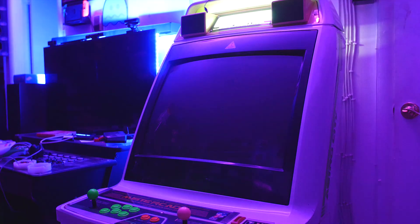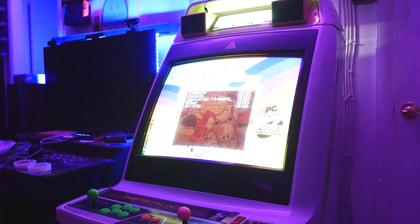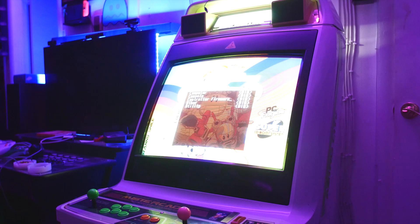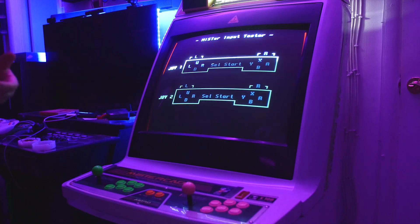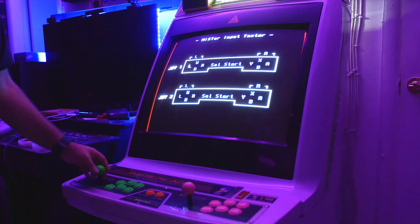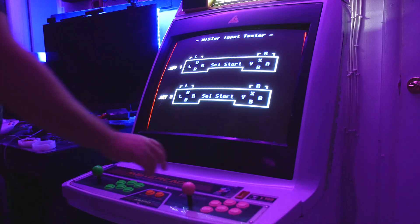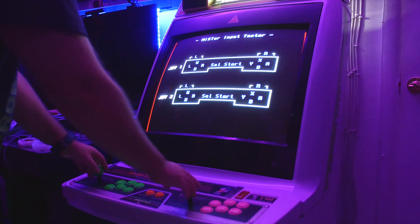The Sega Astro City is turning on — get ready for high quality graphics and sounds. No way! The very first time I plugged MrCade into my arcade cabinet it booted up and within seconds I saw the familiar MiSTer interface we all know and love. However, my harness wiring was off — very off. I press right and it goes up; I press left and it goes down; up is left, down is right. I need to rotate the joysticks counter-clockwise.